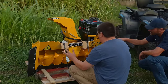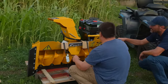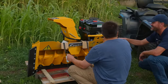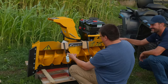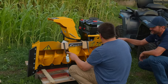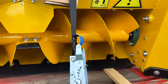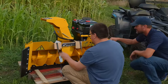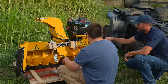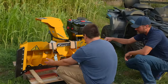There are no shear pins on this snowblower. If there's a rock or a piece of firewood, the MDS system allows it to bypass — it'll either shoot it up the chute or the engine will stall. You just disengage the clutch, back up, lift with the winch, clear it out, and restart. The pillow block bearings on both ends of the auger are large and greasable — not plastic or bronze bushings that wear out. The main wear parts are the rubber flap, skid shoes, and scraper bar.